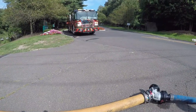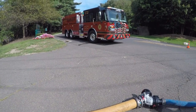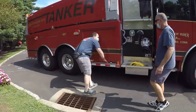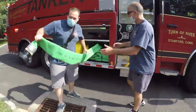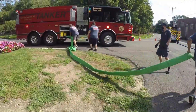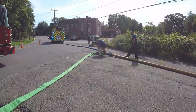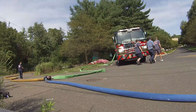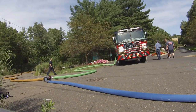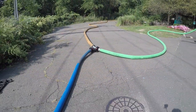When the first tanker arrives to the Siamese, its primary responsibility is to nurse the fire scene. Turn of River's new tanker is equipped with new, quick-deploying, 3.5-inch supply hose. In under a minute, the fire scene can be supplemented by an additional 3,000 gallons of water. With two hand lines in place, this amount of water can supply the scene for up to 8 minutes of continuous operation, providing the time needed to set up a water shuttle operation if the fire scene escalates.